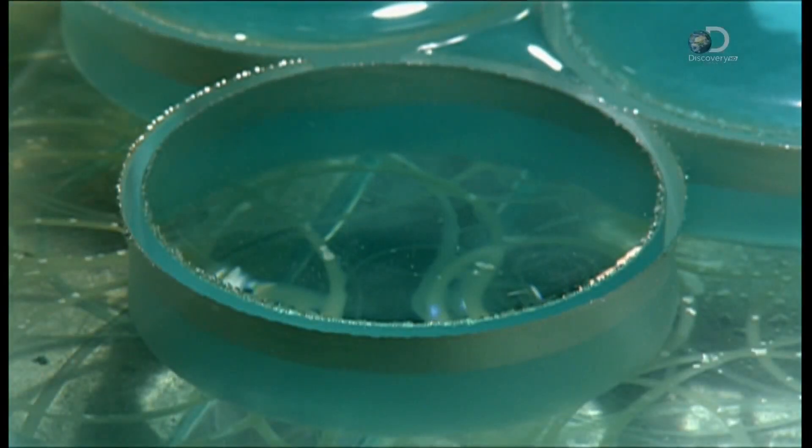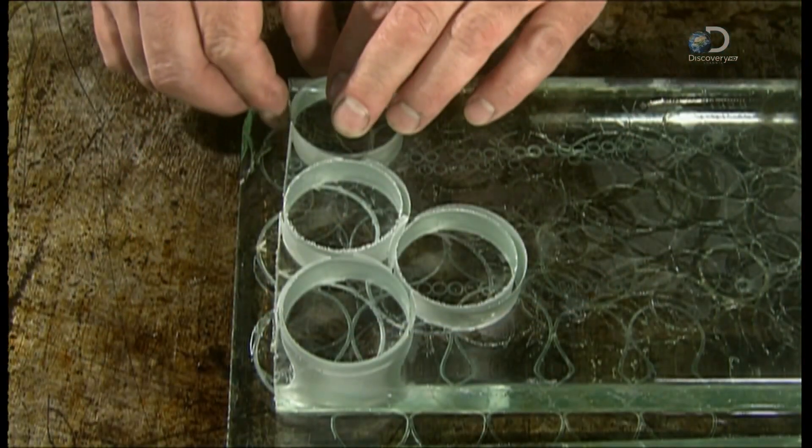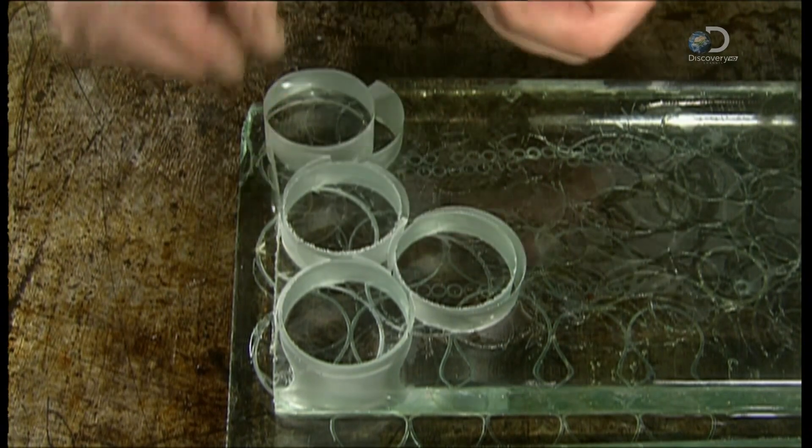During the drilling, the optical glass sits on a thinner piece of glass covered with wax. The slices go under a diamond drill, which cuts several discs from one glass slice. As the wax is melted, the discs are easily pulled away.